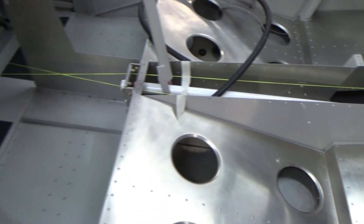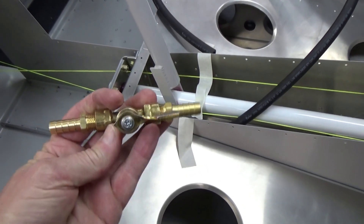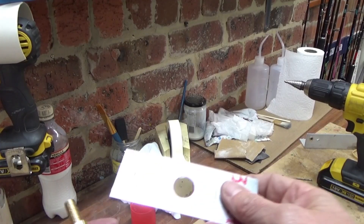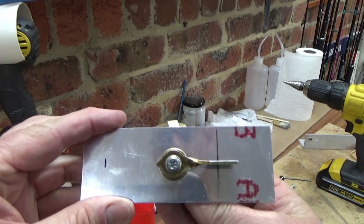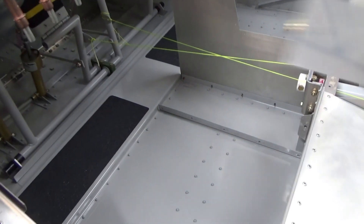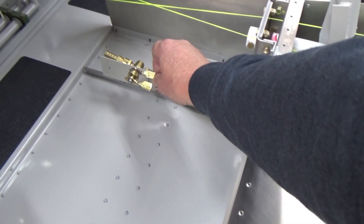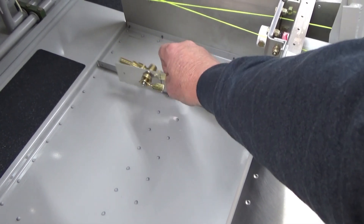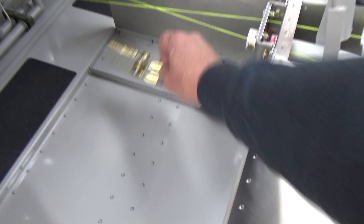A bit of pre-planning for my fuel system. I've got the Zenith-supplied fuel shutoff - might as well use it, it's a fairly sturdy unit, not the most attractive thing. When it's mounted in a bit of aluminium you just see the tap. I was going to mount that on the side console down the bottom somewhere, but it just pokes out an annoying amount - I'm going to kick it at some stage, even when I'm wearing thongs. More importantly, I might stand on the tap and turn it off. So I'm going to recess it in - build a little box and recess it in.